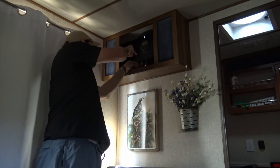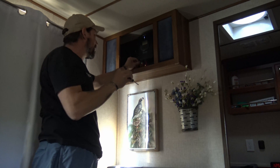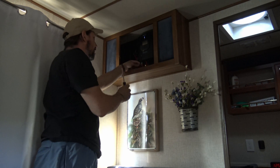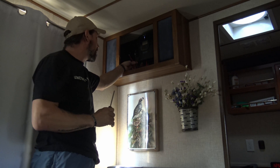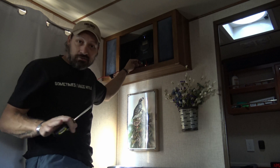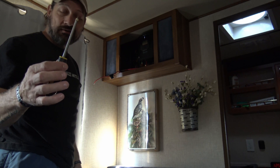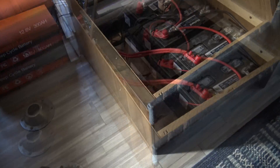I'm going to take a Phillips screwdriver and disconnect the negative terminal from the solar panels as well as the positive terminal, so that there are no solar panel voltages coming in. Make sure that these wires are separated so they don't have any potential to be shorted out amongst each other.